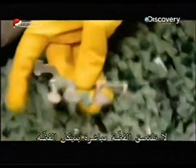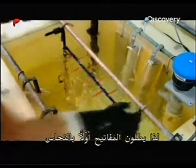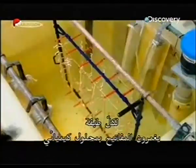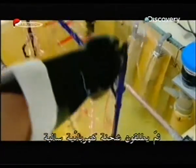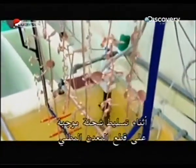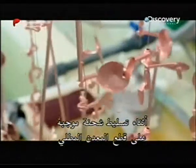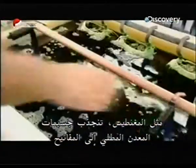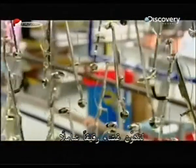Silver doesn't adhere directly to nickel silver, so they plate the keys in copper first. For each layer, they submerge the keys in a chemical solution, then apply a negative electric charge, while running a positive charge to pieces of the plating metal. Like a magnet, this draws particles of the plating metal onto the keys, forming a thin overall coat.